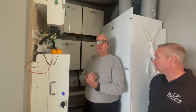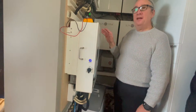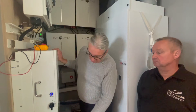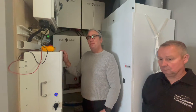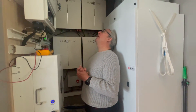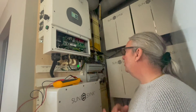We'll do our test. We checked the RCD here and before, on the three phase, we did the bonding — we bonded the earth to the neutral because it's a permanent installation with no grid. When you click the RCD it'll trip. There it goes — reset it. It only did that because of the earth bond. Everything is fully functioning, all good. We'll put the data loggers on this as well.